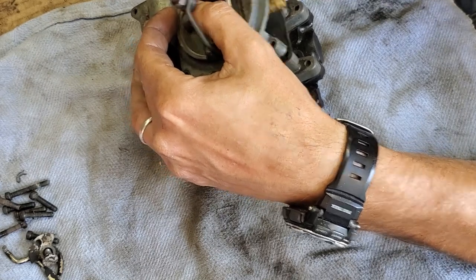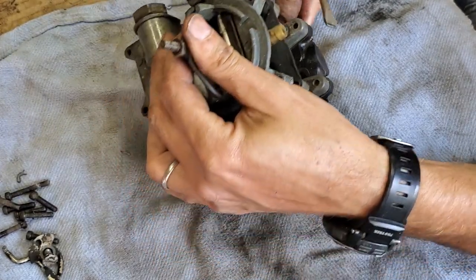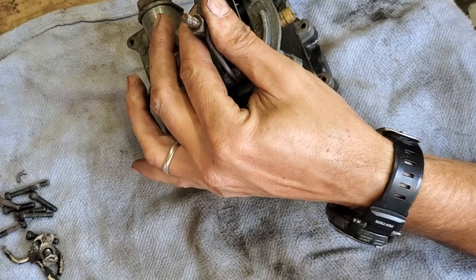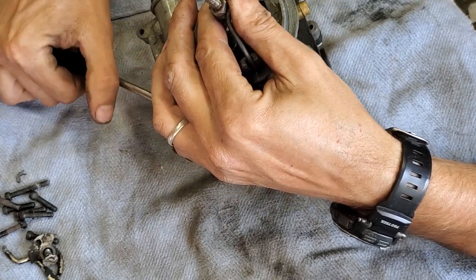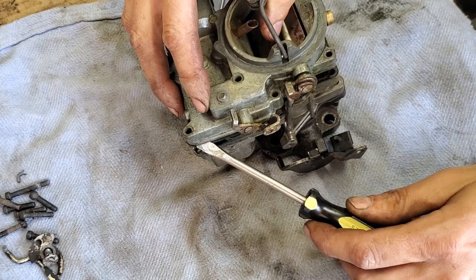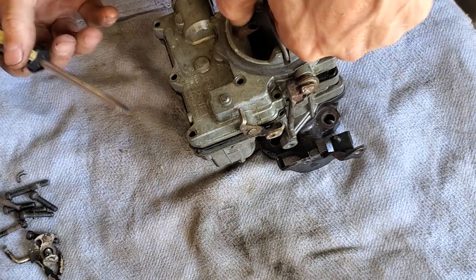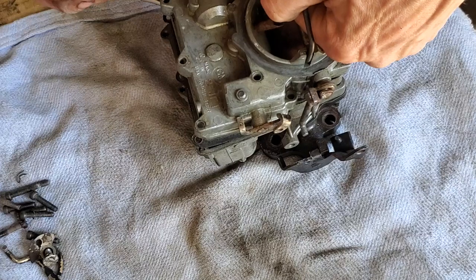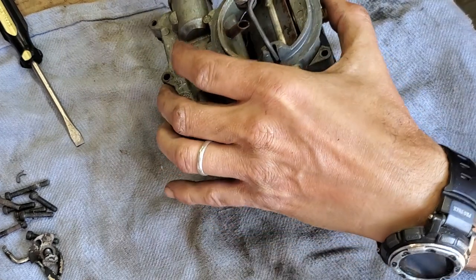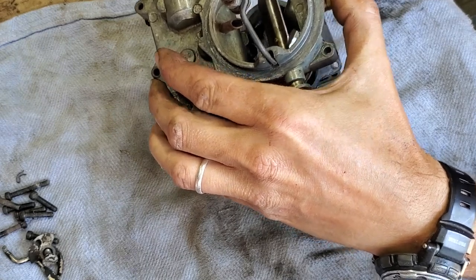If you're in a pinch and you can get this gasket to come off in one piece without ripping too bad, I have had gaskets continually work and work. You just don't want any breaks in them — that's the big no-no. When we rebuild these we put new gaskets in, but you could take this apart and reuse the gasket if you can salvage it, many many times. If you're in a pinch you can even copy this gasket — we actually make a lot of our own gaskets, we have punch sets. The gasket should generally be on the top section.